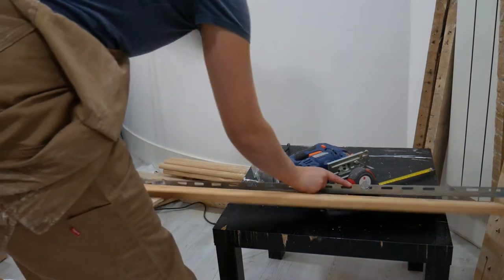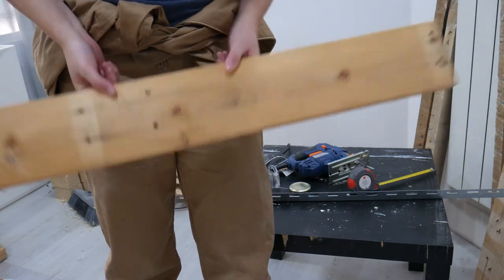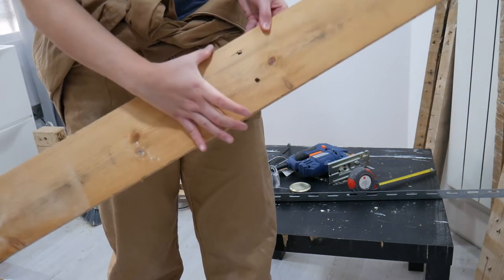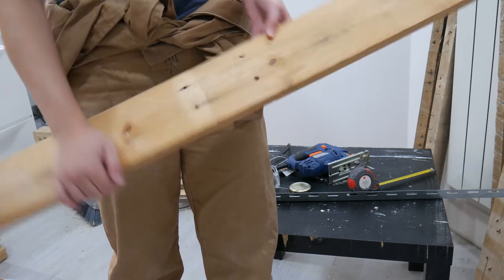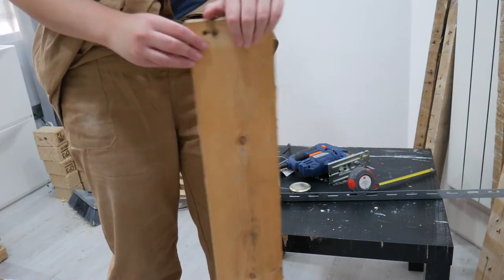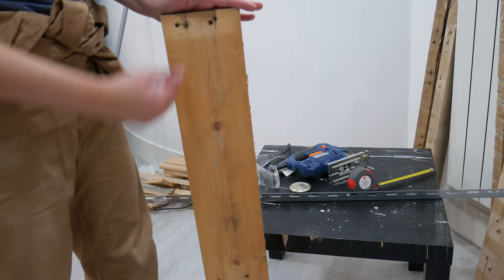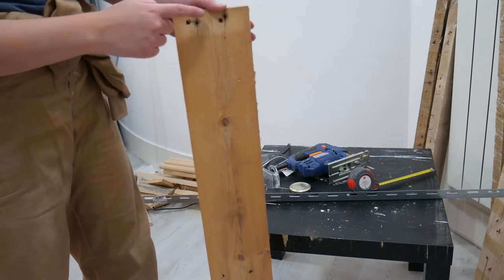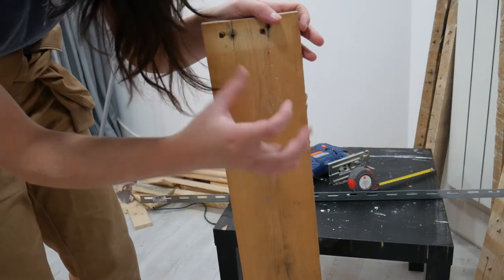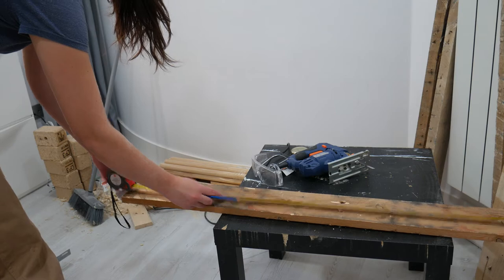Now for the easy part — it's time to start working on the legs and other mobile parts, and this is where it gets a little tricky. I'll try to add a drawn guide of all the pieces in the description to make it visually easier. Starting with deciding the width and length of the legs: I wanted thick, sturdy legs, so I made each leg with two 2-centimeter thick boards of about one meter long, which ended up being a bit tall.